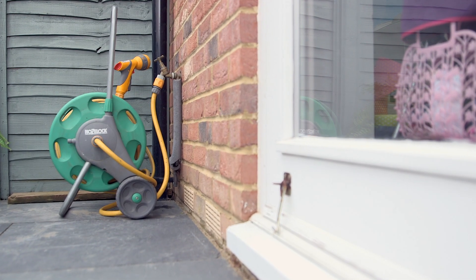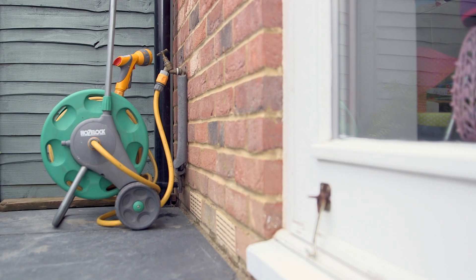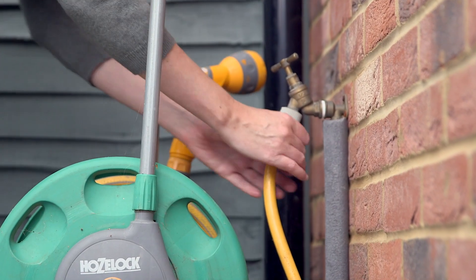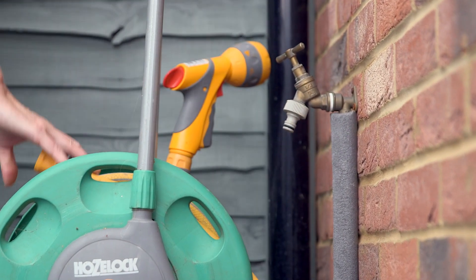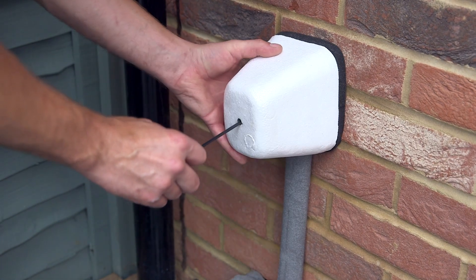Finally, this metallic or antiseptic taste could be caused by having a garden hose permanently connected to your outside tap. Outside taps in homes should always have a double check valve installed. You should remove hose pipes from the tap when you're not using them, and make sure you insulate the tap and the check valve if it is outside, to protect them from freezing in winter.